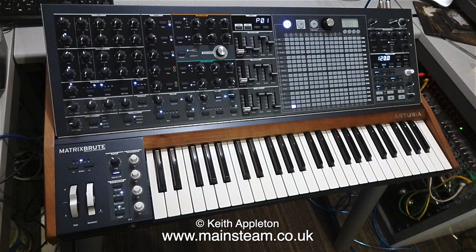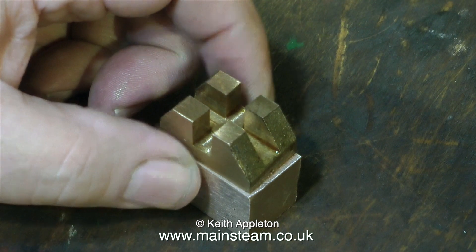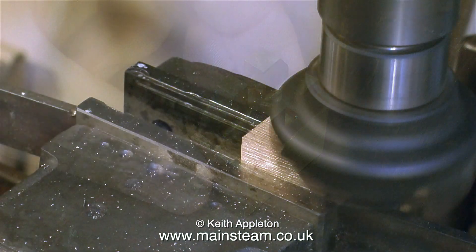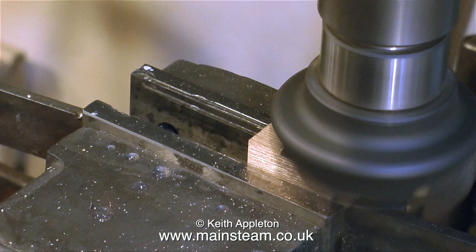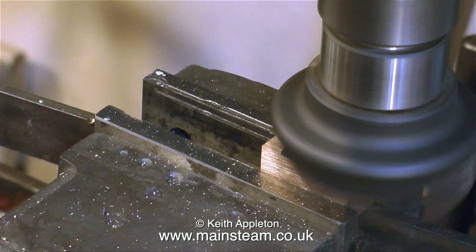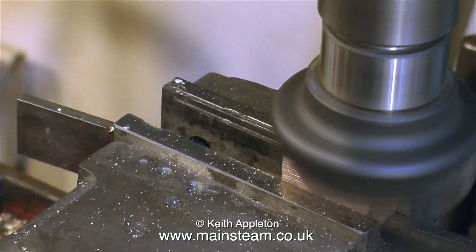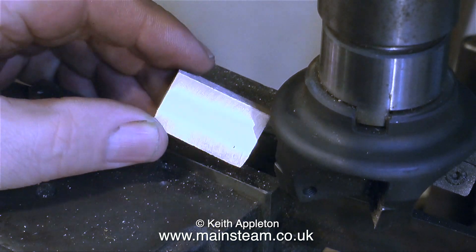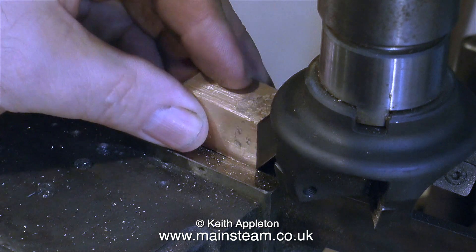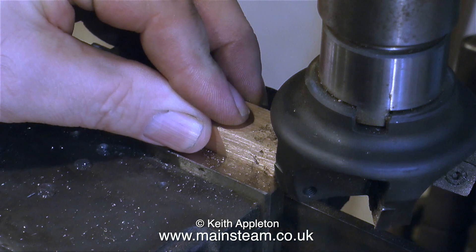Without further ado, it's on with the show. In the clip currently running I'm comparing the old valve with the piece of gunmetal I'm about to machine. When you're doing a job like this it's a really good idea not to rush it. Don't be frightened of the cutting tool — it's very nasty but provided you keep your fingers out of the way you shouldn't have a problem. The idea is to make the block square so now I have one known flat surface. With that flat surface it's time to turn the piece over in the machine vise.